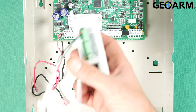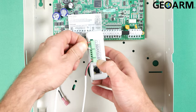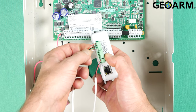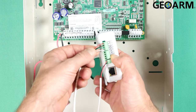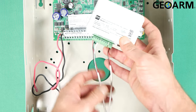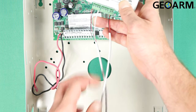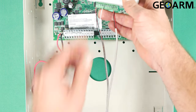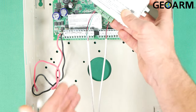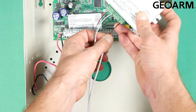Now the next thing I'm going to show you is on the communicator itself. I have already pre-wired this, so you'll see four connections that I've made at the very top. Red is going to be going to plus, black to minus, green to DAT1, and white or yellow — whatever color you have — to DAT2. By the way, you will need two lengths of 18 to 22 gauge four or two conductor wire. This one is a four conductor strip and this one is a two. You're going to need six connections back to the panel, so however you do it is up to you. This is how I was able to do it: my 22 gauge four conductor and my 22 gauge two conductor.